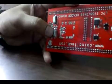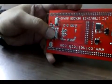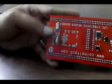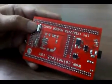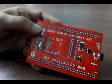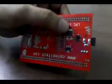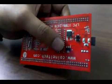There is a 32.768 kHz crystal for the RTC, so the RTC is on-board. There is also a 12 MHz crystal used to clock the microcontroller. The power supply section provides 5V and 3.3V for this board.